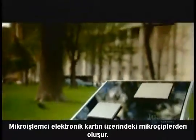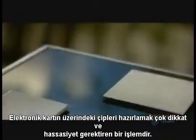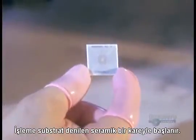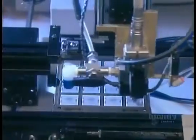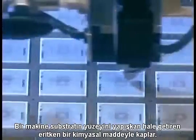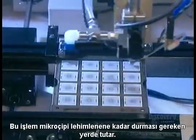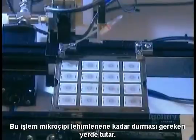It's made up of a microchip on an electronic card. Preparing the chip to be installed on the card is a delicate and precise operation. They start with a ceramic square called a substrate, which will carry the microchip. A machine coats the substrate surface with flux, a chemical that makes it sticky. This will hold the microchip in place until it's soldered.